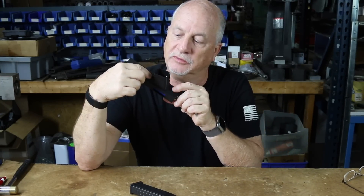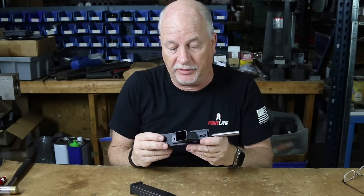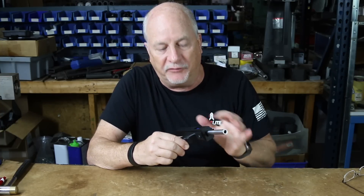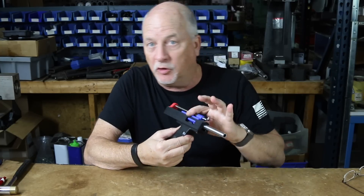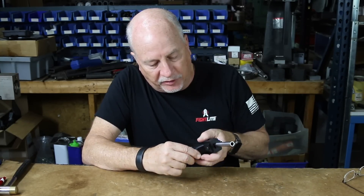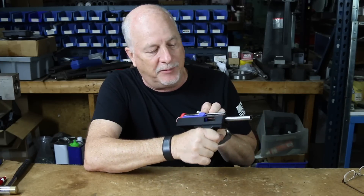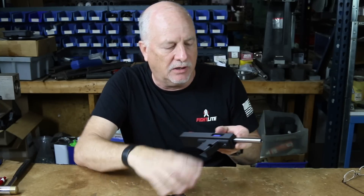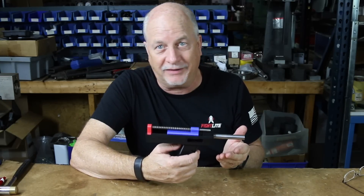As you can see here, I've got two slots so I can just loosen these screws up. I've got a nut on here and here, because plastic doesn't thread into very well. So it's good and sturdy. This moves forward and aft. And as far as up and down, you could just reprint this piece with a mag cutout wherever you want it. The way I figured out initially where it would go is I just shoved the mag in as far as it would go on my bolt — this blue piece — and went down from there a little bit. The spring isn't totally necessary and it's not going to work like a real gun. The dynamics are all off because this is super light. So that tells me I'm either too far forward, too far back, too far up, or too far down.